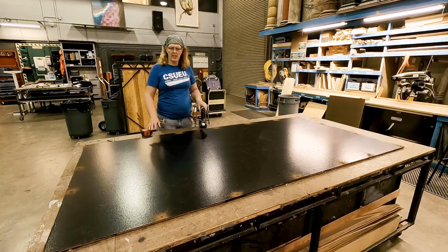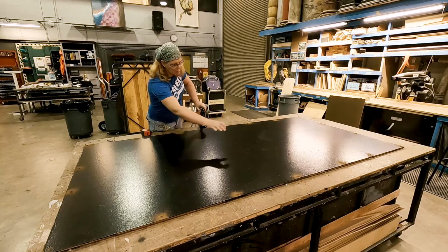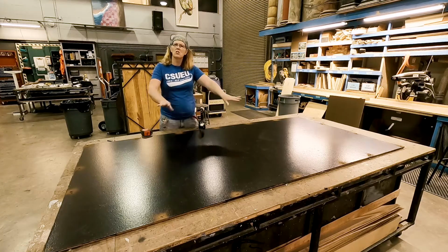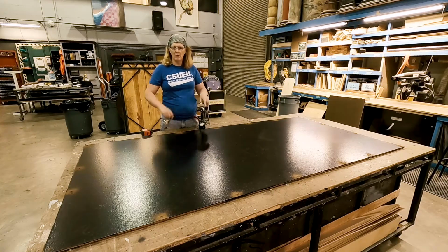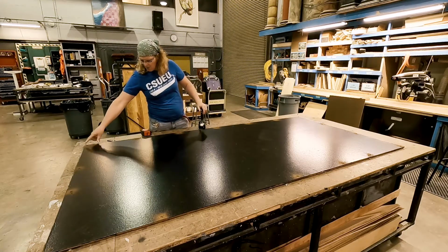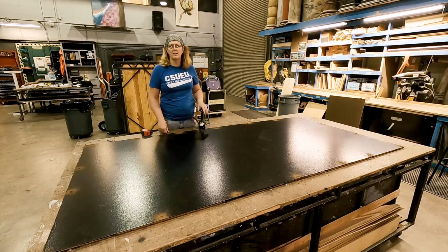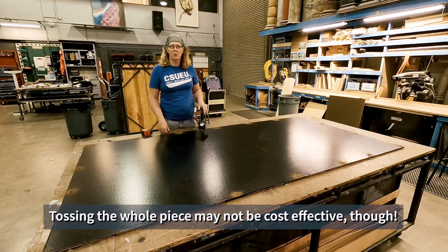But occasionally some moisture will get under something and it'll buckle in spots, and you might have to put 1 or 2 in the middle. But we don't start with putting them in the middle, just in the perimeter. And if we need to put extras here, if I plow through here with my countersink on one spot, I just drill another hole next to it. It's fine. Or you can toss the whole piece and get a brand new piece. That works as well.